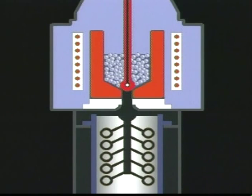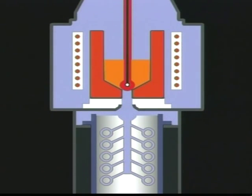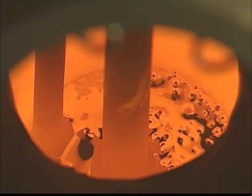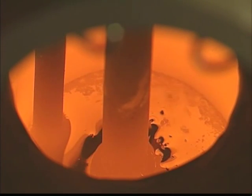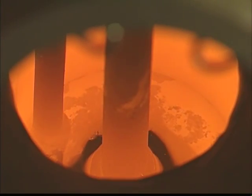Once the lower chamber is closed and a vacuum is applied to the flask, inert gas is introduced around the top portion of the mold, preserving the oxygen free atmosphere where the molten metal will leave the crucible and enter the mold cavity. Keeping the hot metal free of oxygen is only part of the equation for successful casting. Another important factor is good control of the metal temperature. By having the temperature sensing thermocouple at the center of the metal pool, the J2R has accurate measurement of the heating event, allowing you to cast truly close to the preset temperature.